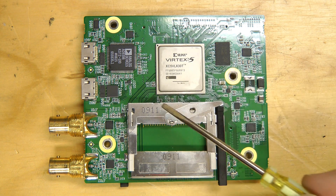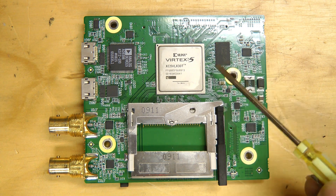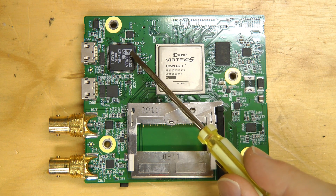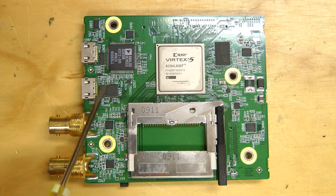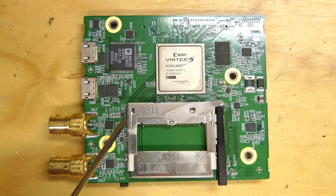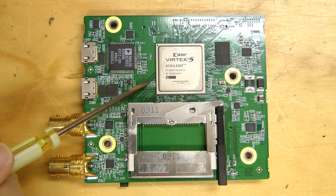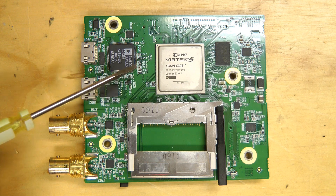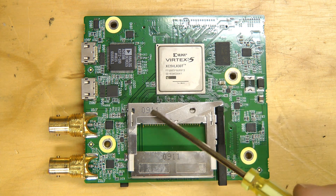Here's the main board. This has a large Virtex 5 FPGA on it — an XC5VLX30T; I believe it has about 30,000 logic elements. It has DRAM connected to it, two power supply control chips, some Analog Devices — the AD9398 is for the HDMI input, this other one is for the HDMI output. These little long ones are ESD protection, and these are single-ended to differential buffers for the HD-SDI outputs. You can see the differential traces coming out from the FPGA. They probably used a high-end FPGA like this mainly for the SERDES, to generate the high-speed serial lines which go up to about 3-point-something gigabits per second — lower-end parts at the time probably didn't have this high-speed output hardware, so there shouldn't be much else that requires the very high-end FPGA except for that output requirement.